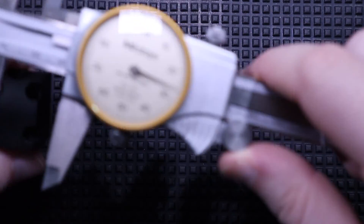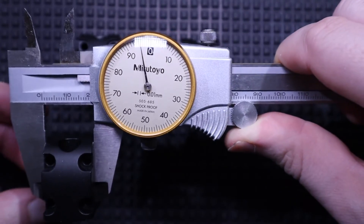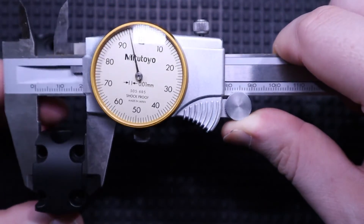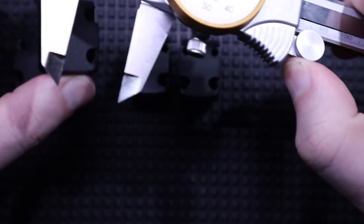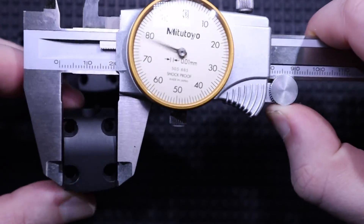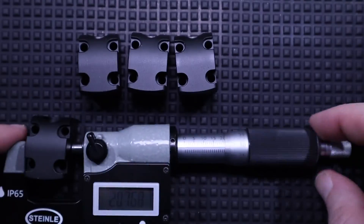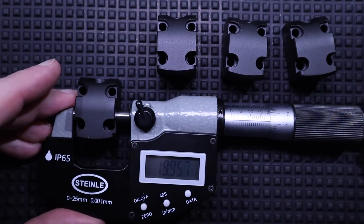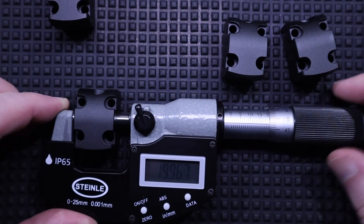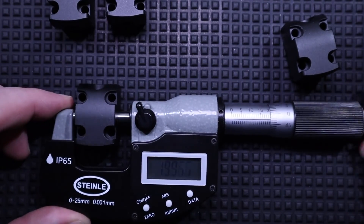Since I did not check which dimensions are critical, I'm taking a part and checking the outside dimensions, then comparing these dimensions with the CAD ones. There are a few ways to determine quality this way: you can check the absolute value of the part, and the overall value across more than one part. You can compare the parts with the CAD drawings to check how accurately they were machined, and if you do that with all the same parts you can check if the parts are consistent.